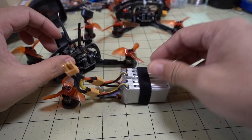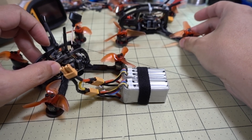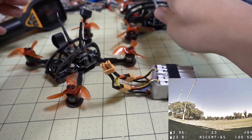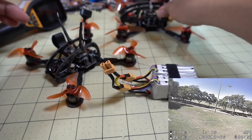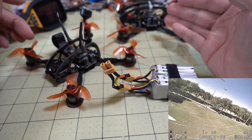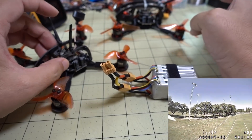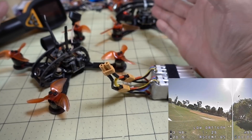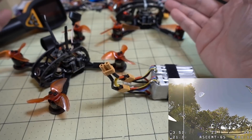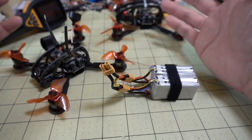Previously, I was running a 6S test on a 3-inch rig using some different motors — these are 1306, 2700 KV. I think the KV of the motor is the big difference here, and also the weight. This is a bigger prop, a bigger frame, a bigger motor, and I was using a bigger 6S battery, like a 550 6S. That one seemed okay — the motor temperatures were fine. It's just that on that setup, it's not all that viable anyway, because you're carrying around a lot of extra weight compared to the weight of the quad.